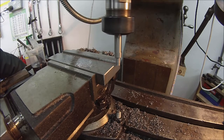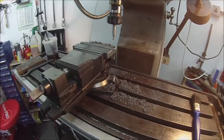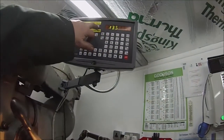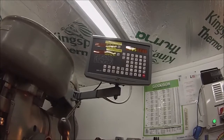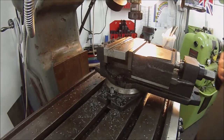and we'll move across 3 millimetres. 6mm tip. So that's our centre point, and our digital readout is currently at 3mm. So we'll re-zero, and that's our starting edge, and we'll take all our measurements from that point. Let's see that okay.